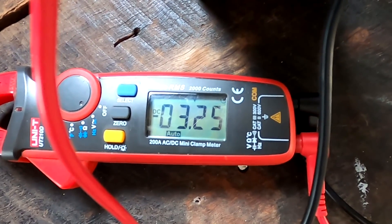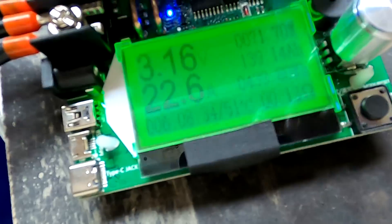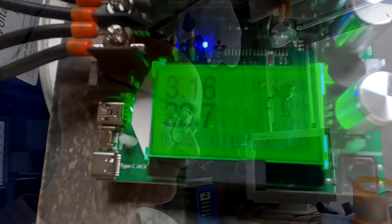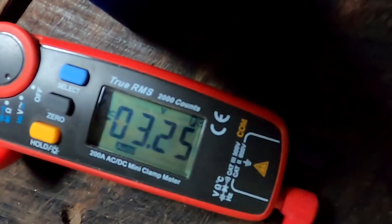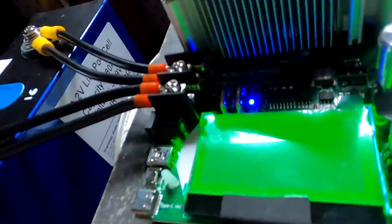Let's measure the voltage — 3.26, 3.25 — right in the middle between 3.3 and 3.2, so going strong. Capacity testing does get a lot less exciting after three times. We just passed the 180 ampere hour mark, eight hours into the test. The voltage is 3.25 — still going very strong. The battery is very strong still. It's amazing.